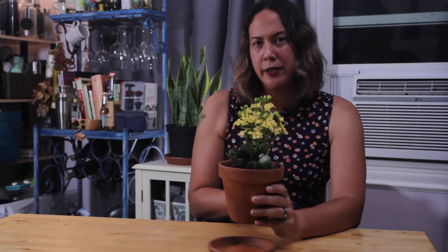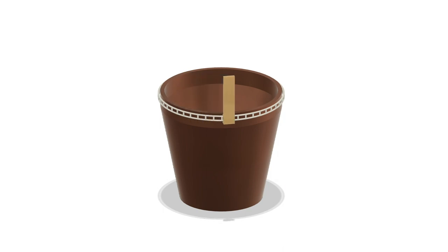So this should be a pretty simple project. I'll use a stepper motor on the bottom attached to an arm that rotates around the plant to take pictures. I'll make the arm adjustable so that I can pan the camera upwards manually as the plant grows. But wait — how am I gonna have an arm spin continuously around the plant when it needs to be connected to wires and stuff? I don't want it to be wireless and have to charge the batteries all the time. Batteries are chumps. And the plant can't just float in mid-air — though that would be awesome. I could have a narrow platform reinforced to hold the plant and the arm would go 350 degrees, then rewind back and take the next photo as if the support column weren't there. That would solve the problem with the wires getting tangled over multiple rotations too. Or I could make a mini train track around the plant and have a small servo traverse it like an orbiting planet.